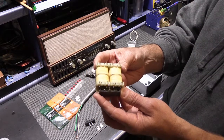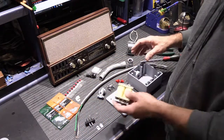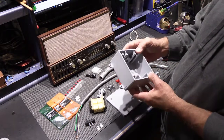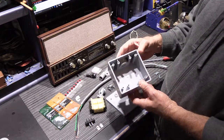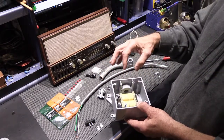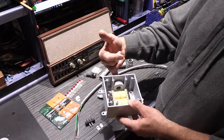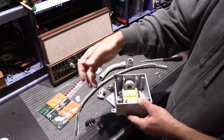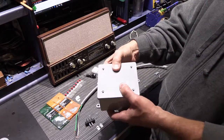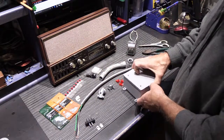That creates a few challenges to convert it into something usable, but I think I have that figured out. For safety and mounting, we're going to use a PVC weatherproof enclosure — a 4x4x2 inch box. The transformer fits down inside nicely, and there are access holes for wiring. We'll put a terminal block on one side for the transformer output, and it will have a cover when installed. This type of enclosure is perfectly safe for this application.